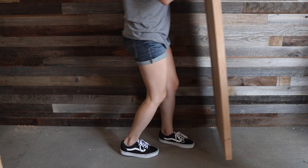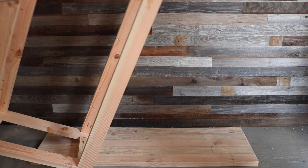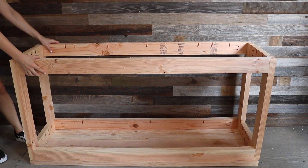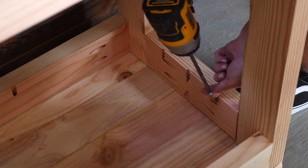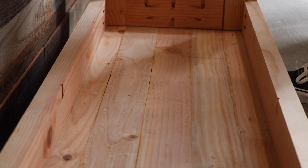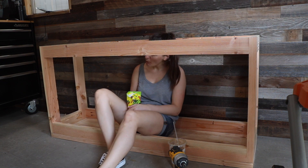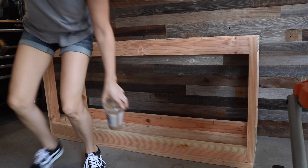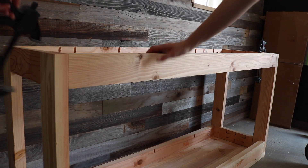After assembling the frame, it was time to assemble the entire lathe stand. I started by placing the top shelf flat on the floor, then brought the frame in to place on top of it. This is about the fourth or fifth rolling tool stand I've built, and at this point in other builds I would attach support braces between the longer front and back pieces for extra support. But I decided to forego that for this one because I need as much space on the bottom shelf as possible to store some tall tools. After attaching the frame to the top shelf and deciding the stand was sturdy enough, I moved on. My published plans do include these supports in case you want to add them to your own stand.